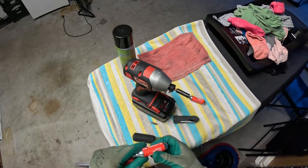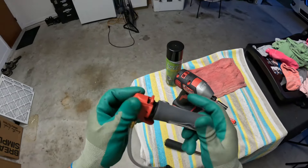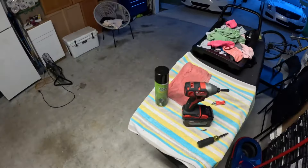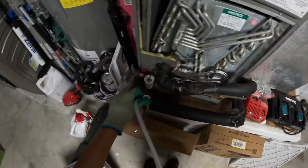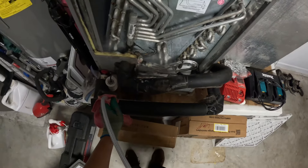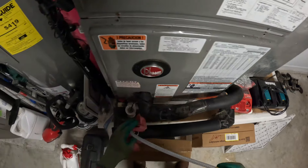Once I've done that, I like to use my drain gun and nitrogen tank to take out any dirt, grime, or algae that's in the drain line. So if it's clogged, this is a perfect way to unclog the drain line. I'll link this product in the description below as well, which can be purchased from Grainger.